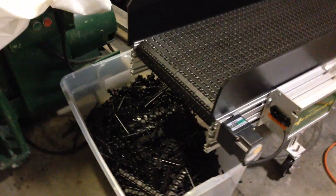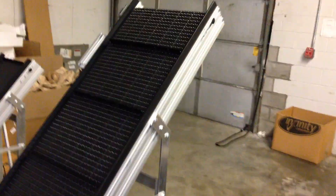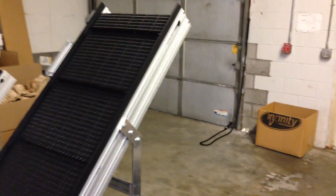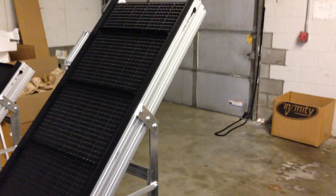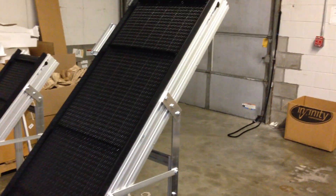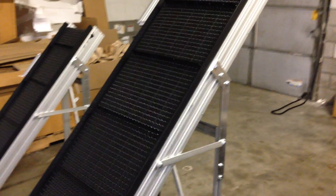They're not really for moving boxes uphill — they're really for moving small parts. You might have a molding machine and have parts going into the conveyor; they might fall into a bin. So you'd have the parts sitting in a bin, and you'd say, well, I have to keep dumping the bin. Well, you put a conveyor under there like this, they fall onto that, carry them uphill. They could fall into a Gaylord and you could run it all night and fill the bin. That's the type of application where you get a conveyor going uphill to get under a piece of equipment.